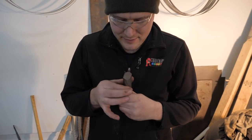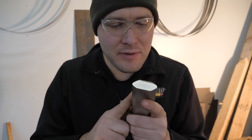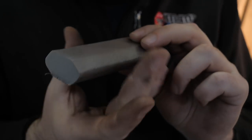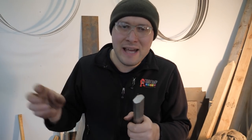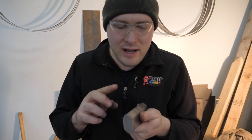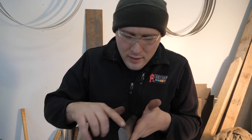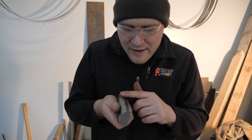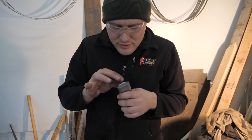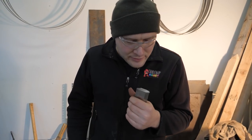These welds are looking clean, clean, clean. Something I'm trying to stress on this billet more than I've ever done before is cleanliness. I've never done the metal surrounding all the way around the billet all the way through every stage — I've only done it random times here and there. So I'm doing that all the way through, and I'm also cleaning off scale on the edges of the billet that I normally just leave on. I'm taking off about 95% of it, going for super super clean — and the welds so far are just absolutely invisible.